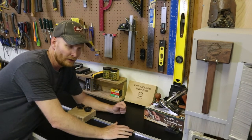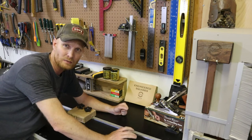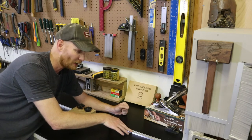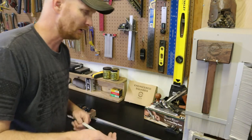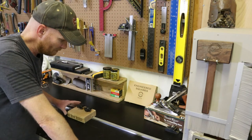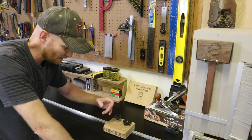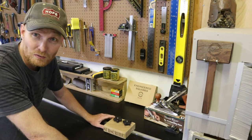Now for the fence — I couldn't decide whether I wanted an actual fence or T-track in my countertops for a smooth surface with a stop lock. I went somewhere in the middle. I'm calling it a minimalist fence: it's literally just T-track on top, with adhesive ruler tape on the back, measured accurately from the blade. For short cuts I'll use a pre-measured stop lock, but for 13 inches or more I've got a white oak stop block — I sanded it down, drilled two holes, added T-track bolts and star handles. And I added a little subliminal message for those of you who aren't already subscribed.